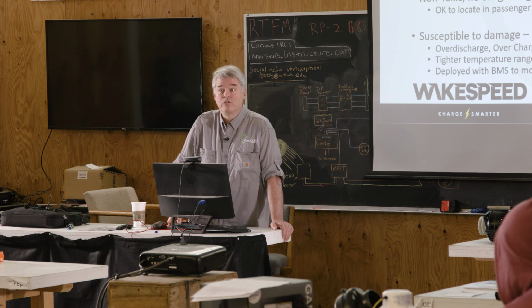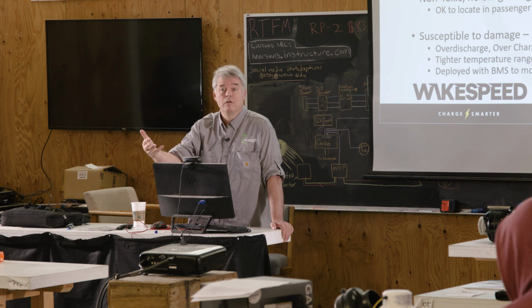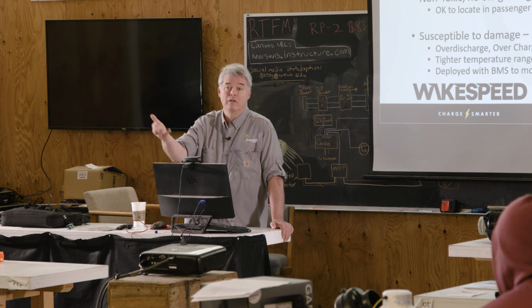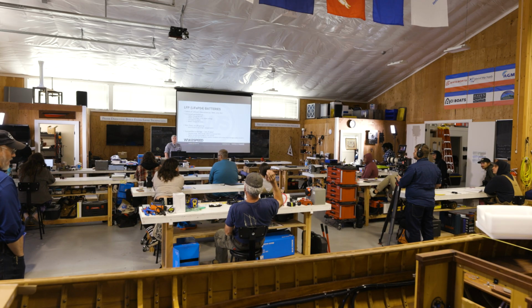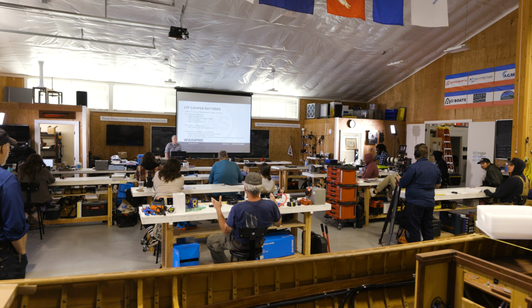Well, AGMs are significantly lower energy density, right? And plus the usable energy density is even less, right? And the weight of the fundamental materials, lead versus lithium, is certainly different. When you refer to energy density, presumably you're talking amp hours per pound and physical dimensions? Physical size in this case.